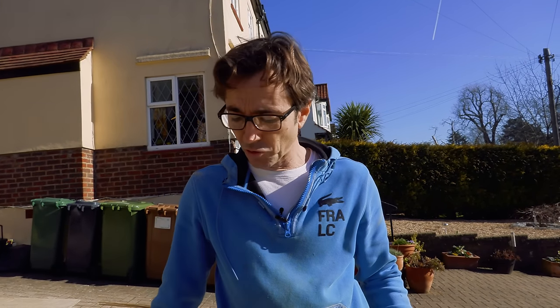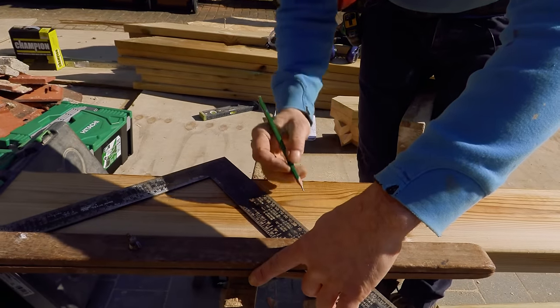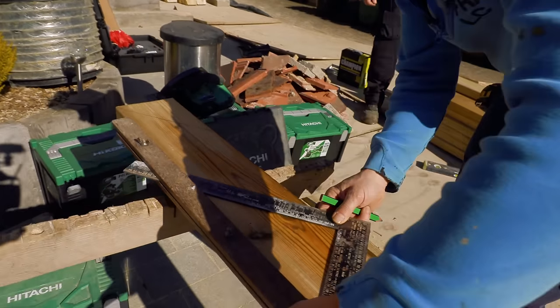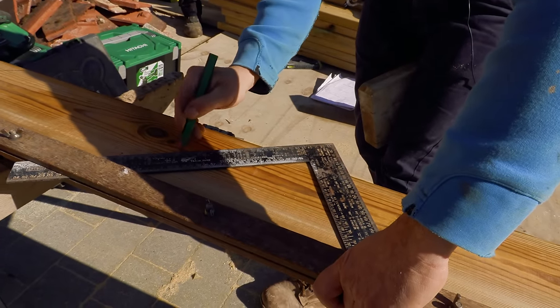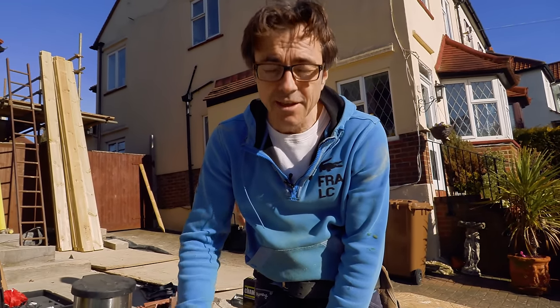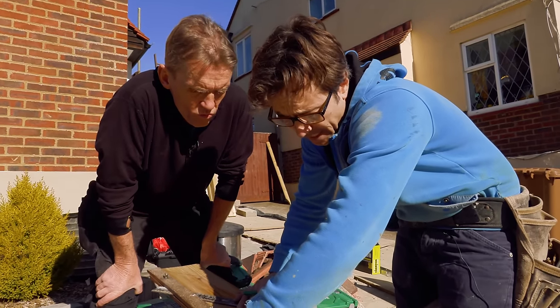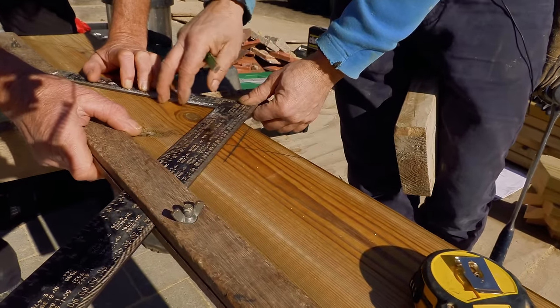I've selected a fairly straight piece as my template — I'm going to repeat these cuts over and over again. The next step is to measure up my drop of 275mm. When I run the square on the millimetre scale, I come to 200, mark a line, go back, add 75mm — that's 75 here. That is the level of my bird's mouth. We want two-thirds of the rafter, which in our case at 150mm is 100mm. Then we use the square, slide it down the top edge of the timber, and mark the bird's mouth. That effectively sits over your wall plate.